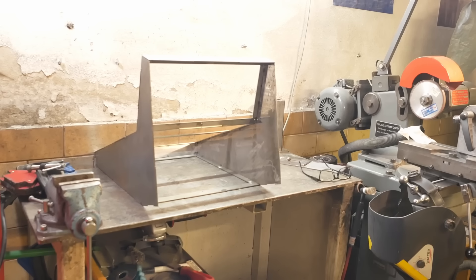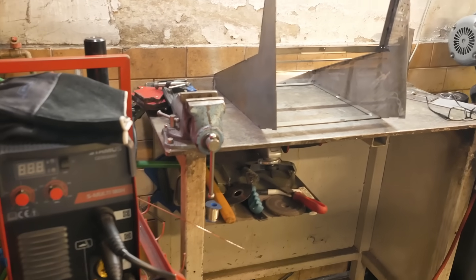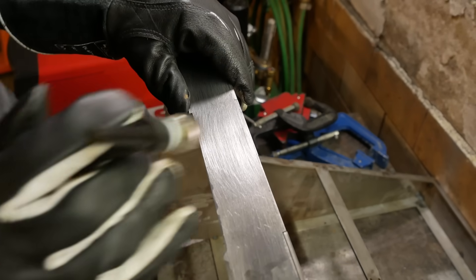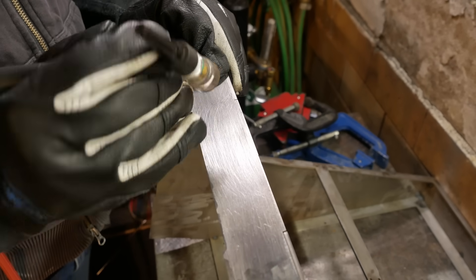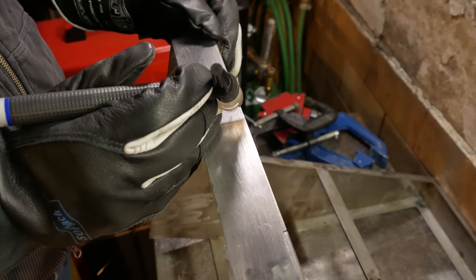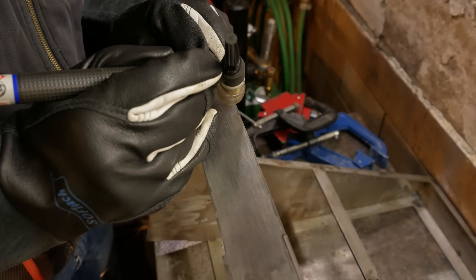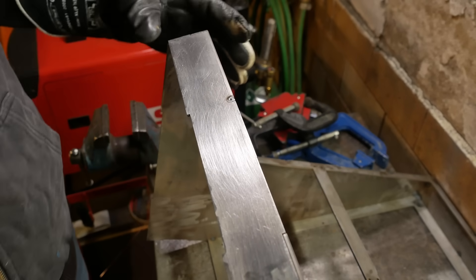There were a couple of really good critical comments last week on my welding, saying I need to use more pre-gas because I'm getting sparks. This welder doesn't do pre-gas and it's only got a fixed one-second post-gas. I've been trying to compensate for no post-gas by coming off the switch to break the arc, moving away just enough so that a new arc won't strike, and then going back on the switch to give me post-gas. I'm still not coordinating it well, so it's not always working.